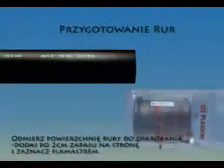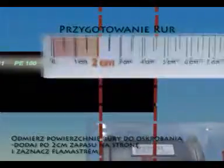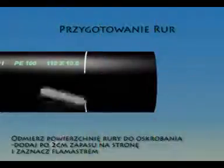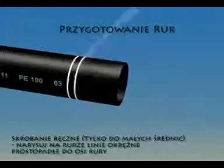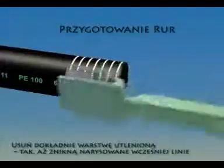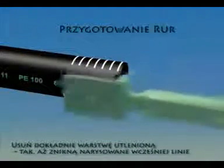The pipe must be measured and marked to prepare for scraping. Measure half the length of the fitting. Add 2 centimeters and mark the pipe. When using the hand scraper, mark the pipe as shown here. Good scraping will make those marks disappear.